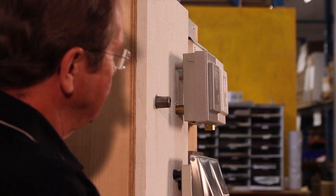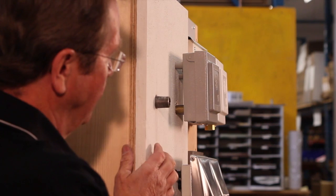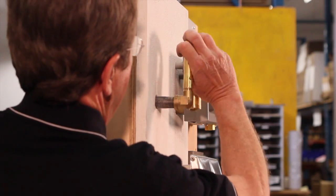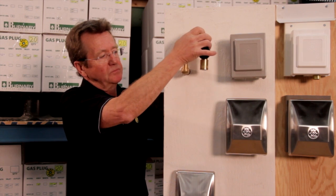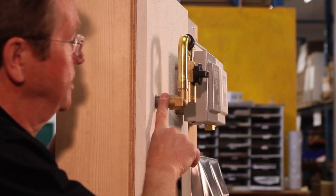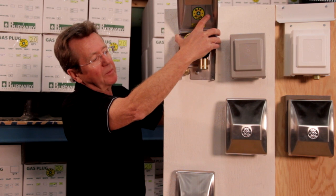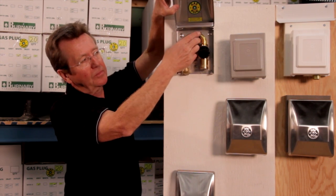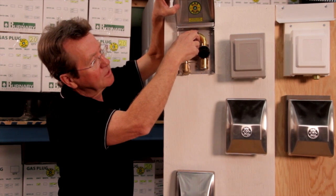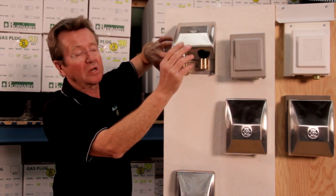Now we've got a shot from the front. Remember that this pipe needs to move. When allowing for your distance on the nipple, get yourself out about five-eighths to three-quarters of an inch of thread, and while you're working on it you'll pull it out to give yourself plenty of length to work on. Take your piping assembly and tighten it — I won't tighten it firmly here just for demonstration purposes. Now you're going to test it — either soap test it or test it with air as required. Once you know that joint is tight, put your box over top, open it up, center your cushion clamp to the center screw, put the screw through, and that secures the whole assembly and box to the wall. Straighten it out before you put the other screws in, and that gives you your installation — it's as simple as that.